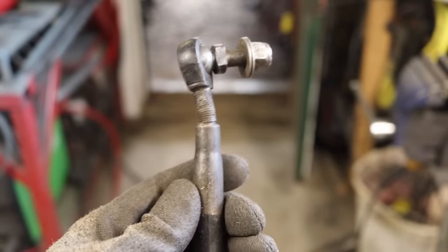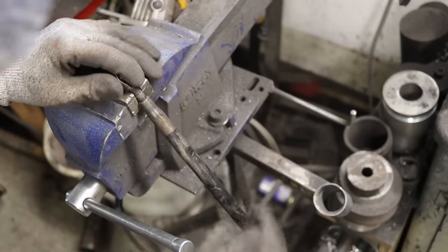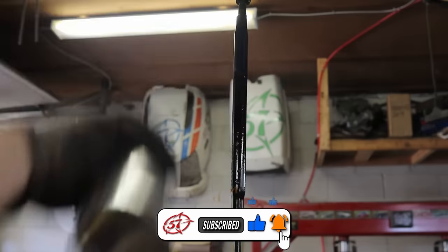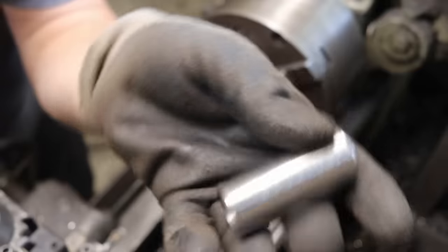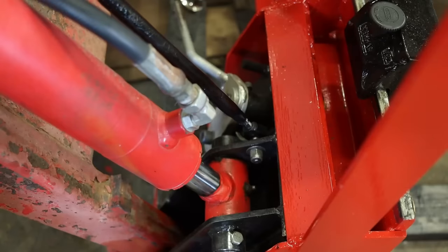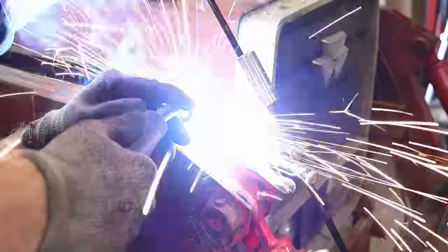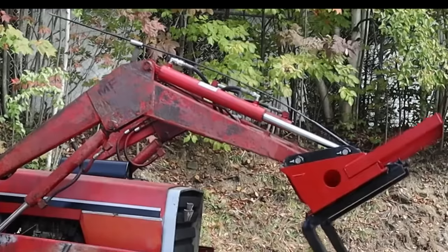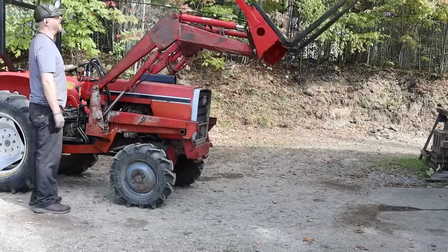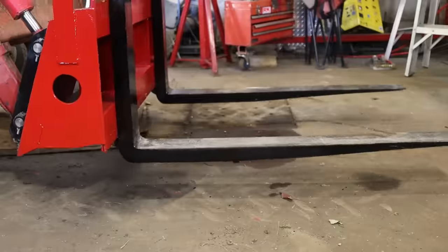The second thing I need is a visual gauge — something to tell me if the forks are level to pick up a pallet. I'm going to make that gauge from a bent ATV tie rod. I took it outside to mark, at full extension, where to cut the rod. Then I cut the extra length up front, leveled the forks, and now I have a visual marker.